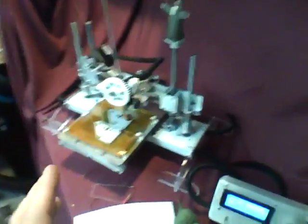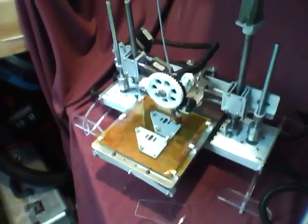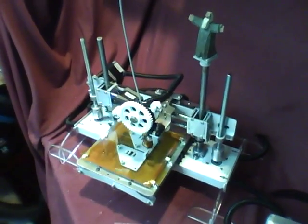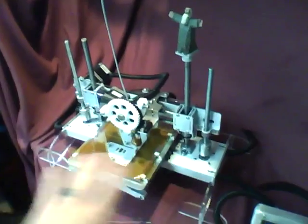The last cut will be labeled 'last cut full' or 'last cut through,' or sometimes it'll be like '0.125 plus.' That basically tells me it's going to be a through cut — which will be the thickness of material plus however far you want to cut into your sacrificial piece.